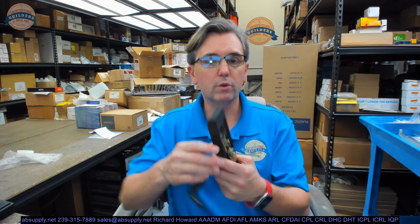what lengths you want to dive into to figure out different ways to turn a classroom into a storeroom function. I'm pretty sure there's a way that you can do it with limiting the rotation, maybe using a Brinks cylinder, but the way that we show, just by inverting the cam, modifying the cam, either a straight cam, a Marks, Kaba Ilco Mark style cam, or even a cloverleaf cam can be done as well. A couple of different ways to do that, and that video will show you how to do that. Let me show you the screw package.